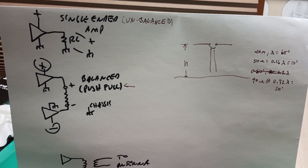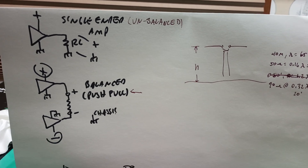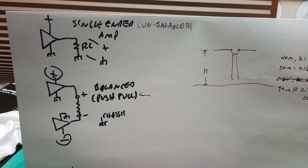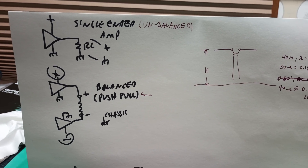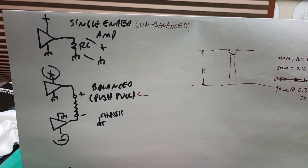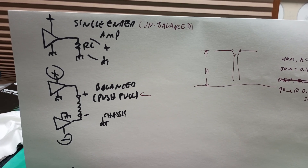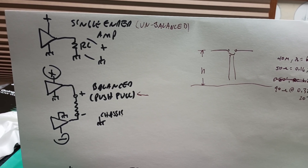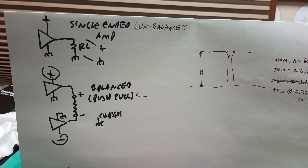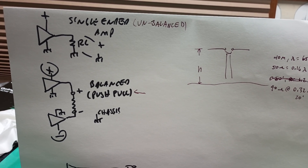Here's the meaning of unbalanced and balanced, especially important when it comes to grounding. Unbalanced is what's known as single-ended — a single-ended amplifier. The triangular shape is an amplifier; the top is the plus power supply, the bottom is ground or chassis. The load is referenced from the amplifier output, which swings from plus to ground, referenced to ground. The fork symbol is chassis. That is a single-ended amplifier, which is probably what's in our radio equipment. By virtue of one side of the load being referenced to the chassis and using coax with sockets fastened to the chassis, we have the convention of the transmission line being unbalanced — which again is about the amplifier, not the line.